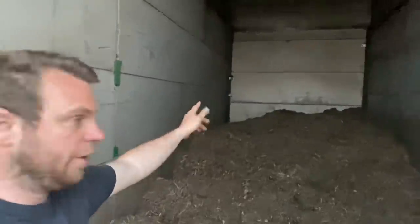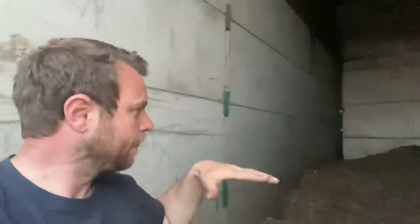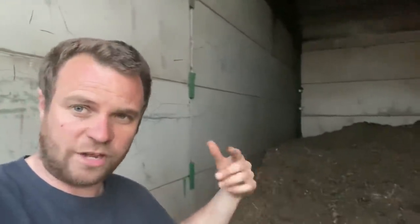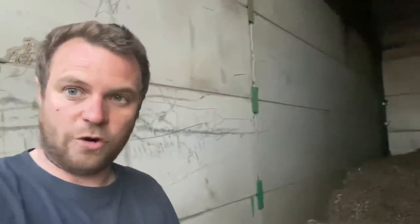That wall at the back there has a slot underneath about, I don't know, 2 foot, and the chip then falls through the floor. There's a big hole underneath the floor at the back under that wall into an auger, just like you'd have on the front of a combine, on the header, that pulls the material to the middle of the machine. Once the chip falls through there, it goes into the middle, drops down into another auger, which then feeds itself up into the boiler.